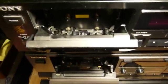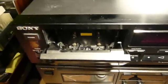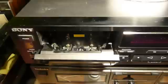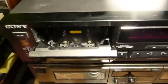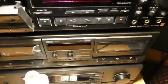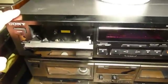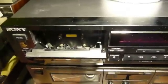Now you have taken care of your cassette deck's regular maintenance needs. You've cleaned the tape transport and demagnetized it as well. Let everything dry out for a couple more minutes, then get your tape and try it out. If your machine was really overdue for a cleaning, you're going to notice that the high end of your audio will have returned and everything will sound a lot better. I've prepared a demonstration tape recorded on the Technics deck, and I'm going to play it into the computer so you can see if you notice any difference before and after cleaning and demagnetizing.